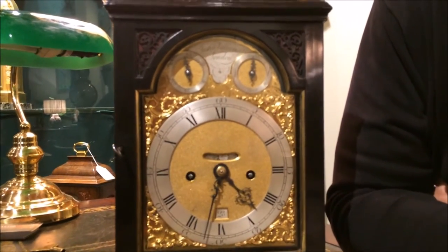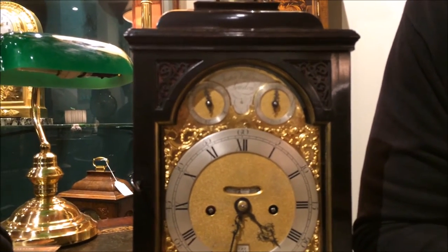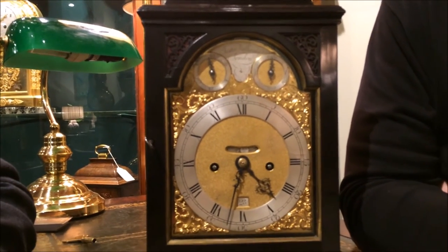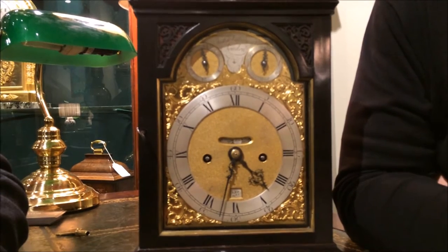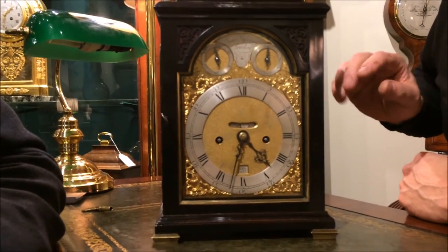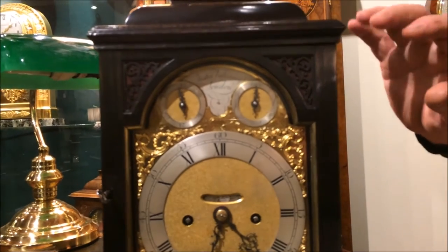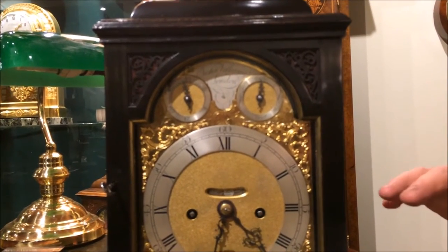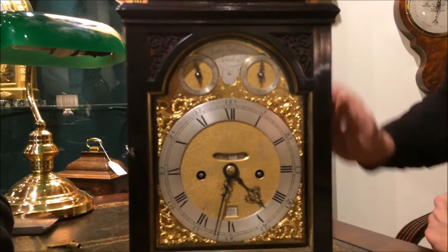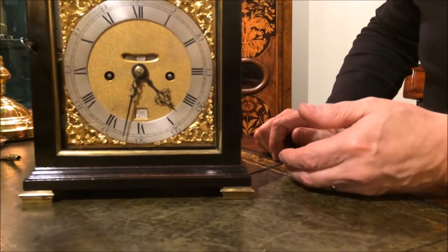And these two subsidiary dials? The two subsidiary dials in the arch flank that most wonderful nameplate. On the left is what's called the rise and fall regulation dial, with a hand that you adjusted so that you didn't have to turn the clock around and alter the pendulum for timekeeping. You could make it gain or lose simply by adjusting that hand with the micrometer settings, which actually altered the pendulum length via the suspension and brass chops. Very clever. The one on the right, of course, is your standard, although very small, strike silent dial. So by moving the hand, you could instantly put the clock onto silent — if you were busy listening to somebody, needed silence, or were sleeping with it by your bedside. The clock will keep running but would not strike unless you pulled on the repeat cord to the side, and then it would strike the last hour on the bell.